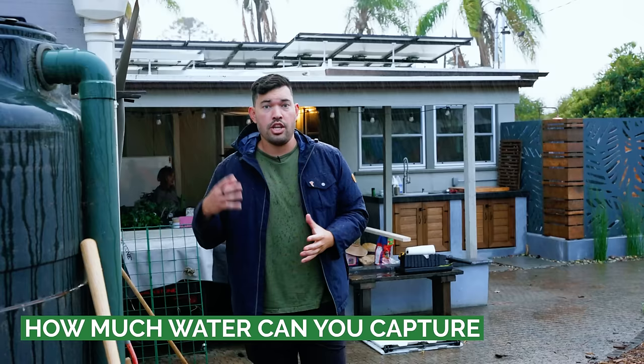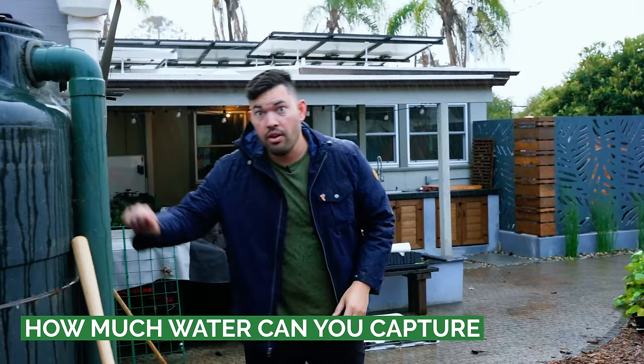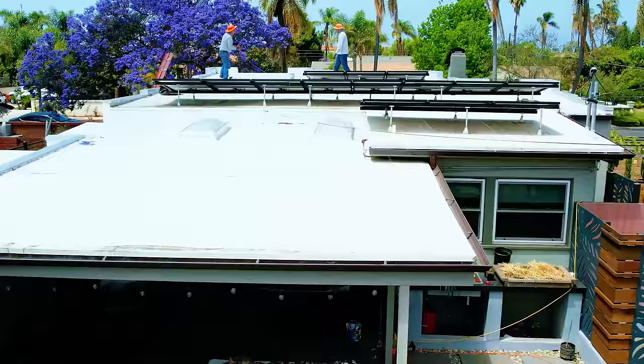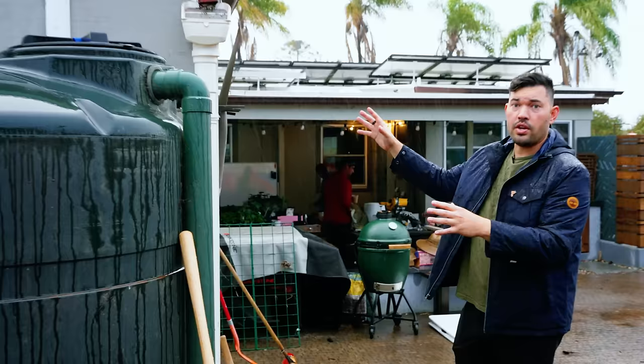The first thing to know is what type of roof you have and how much water you can actually capture off it to store in a barrel. Let's take a look at the garden shed as an example. A general rule of thumb — I'll put metric up as well — is that if you have a 1,000 square foot roof and you get an inch of rain, that is 600 gallons worth of water that you can capture. Here's the garden shed: you can see we have a gutter, a roof, and this contraption I'm about to show you.